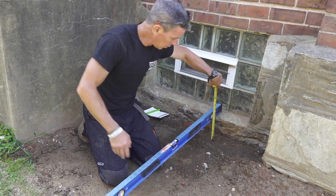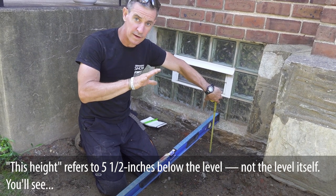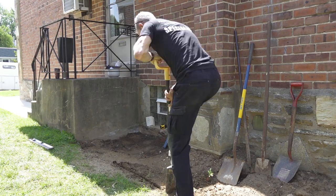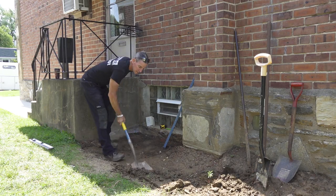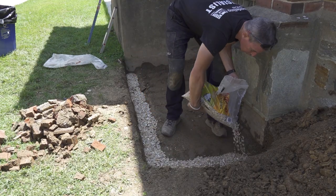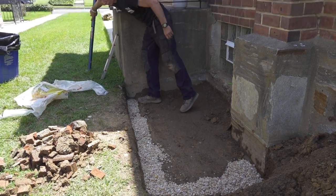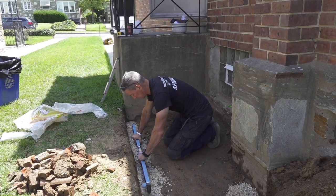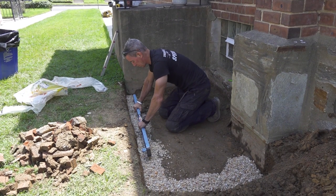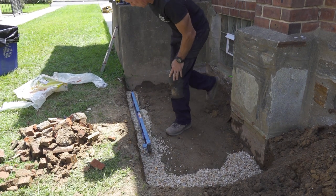We're going to put in our perimeter, fill stone to roughly this height, then level that and put our joist system on top of it. We want a nice flat, level-ish surface with a clean edge. The perimeter trench is about three inches lower than the pad area — this will support the perimeter pieces. The secret is to make this reasonably level in all directions.